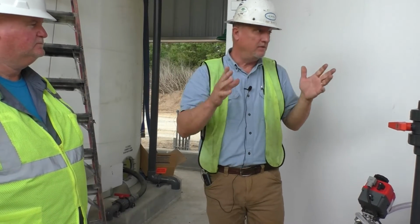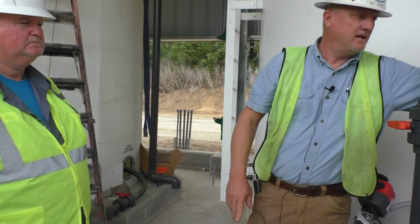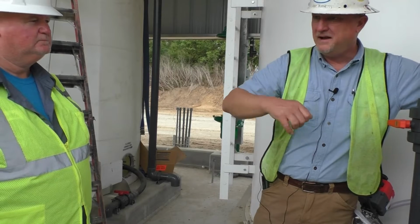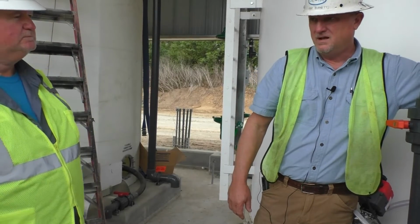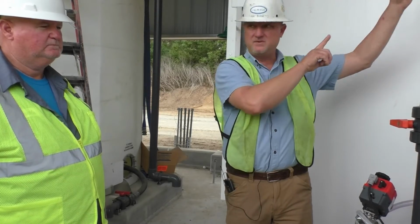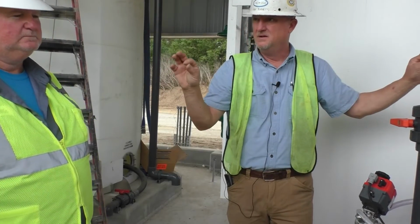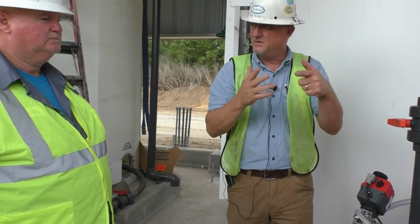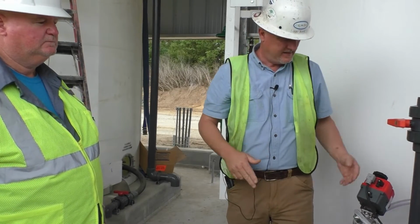Now, I caution you, don't cut these lines and say, hey, I want to get a sample line or something in it, or put a little valve in it. Don't, because that's where you'll get a clog. We specifically designed this thing with one continuous feed line, no breaks, one smooth tube. So don't go up there and cut in and put a T in it. No, that's where it'll clog, because it'll hit that T and it'll turn.